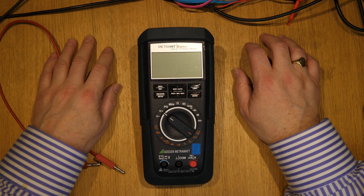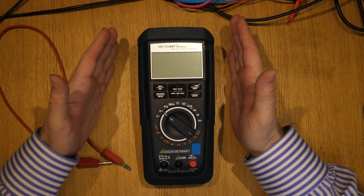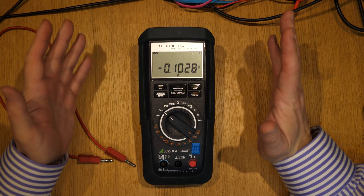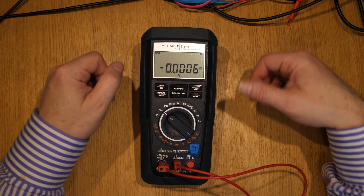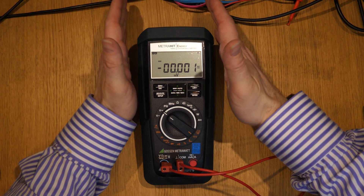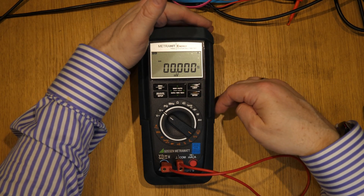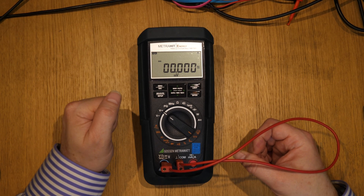Greetings folks, here's a little test for Joe Smith — he's had some problems with his MetraHit. It's not the same version as this, but does this MetraHit Energy have the same problem he had where proximity of your hand changes the voltage? I did a quick test: shorting out the voltage on common, switching to manual mode millivolts at the highest range, so we're down to microvolts. Wherever I move my hand it's not actually affecting the reading, which shows something is different to Joe's meter — it isn't affecting this one.